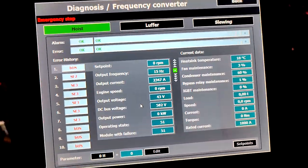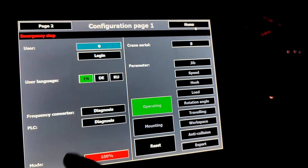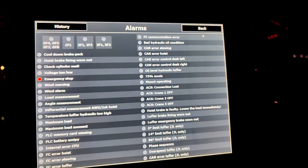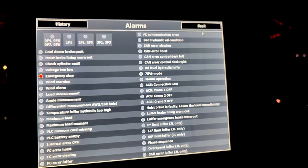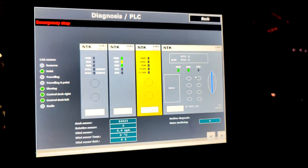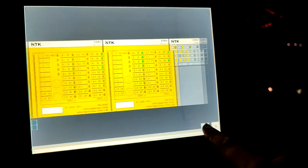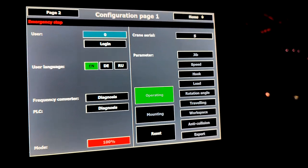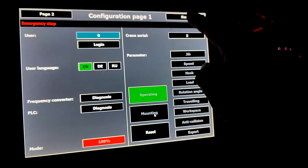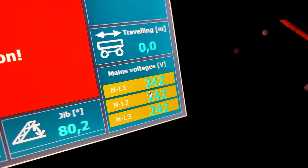Page 2 takes us to the F settings. You've got settings for the hoist, the luffer which is the jib, and the slewing. PLC - let's have a look at PLC. That's what PLC looks like - you've got all of those. Let's press that - nothing. It's all PLCs on this. Let's look at PLC settings. Crane serial: five - fifth crane ever built, I don't think so. Page 2 takes you to your voltages - phase to phase: 418 volts, phase to neutral: 240 volts. That is all correct, that's what the voltage should be.